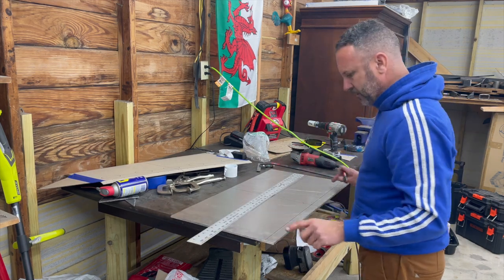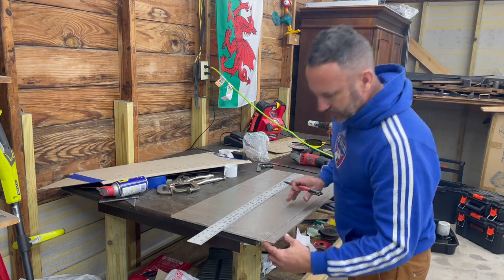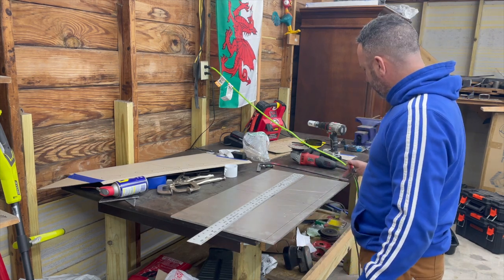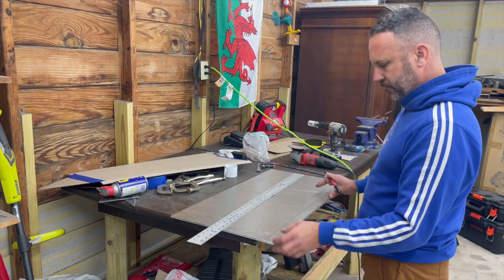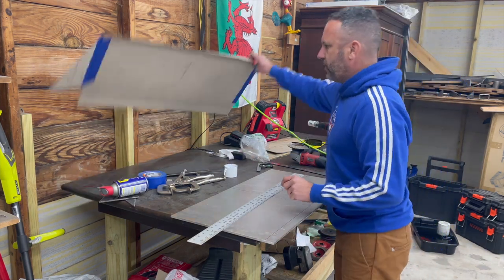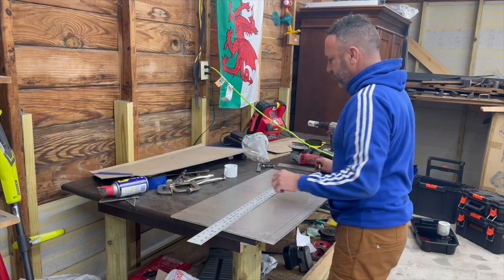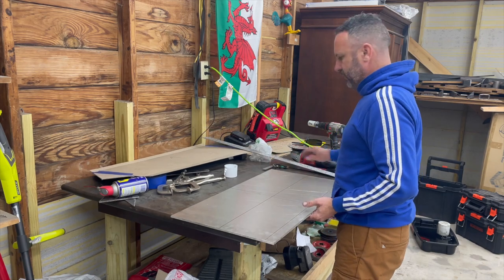This top line I just drew is going to be a cut line. I'm going to take the grinder and score it down to maybe an eighth of an inch, then bend this up so it has a face I can screw through, and I'll have to backfill it with some welds once I get the TIG welder set up. Even with the crease in it temporarily it should be okay. On the template I put in another crease to even out at the two-inch mark, so I'll draw that up in case I want to put that in later.